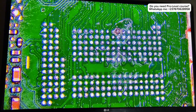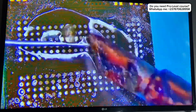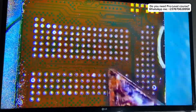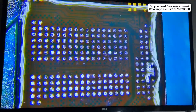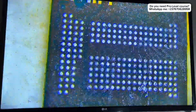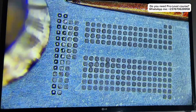We have to make the solder balls of the chip, then reball it. We just have to clean it off because it's still the way we removed it from the PCB. Using solder iron, clean everything up. The temperature I used to remove the chip was 350 degrees — you can use 350 to 370. These temperature settings depend on how you handle it. I'm surprised to see people using 500 degrees, but they do it perfectly — it's all about how you handle it.